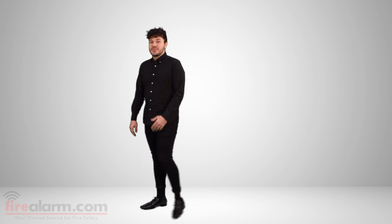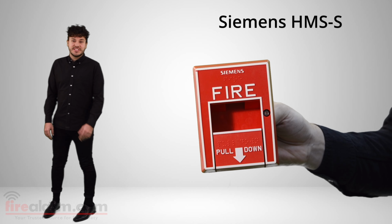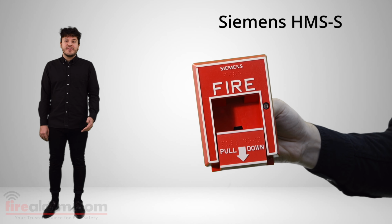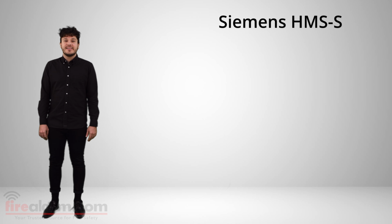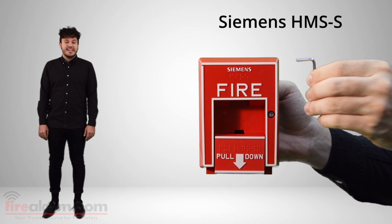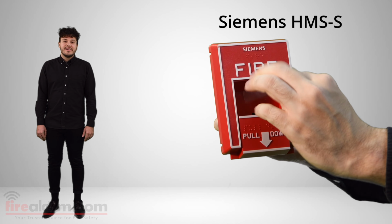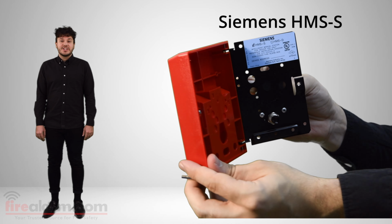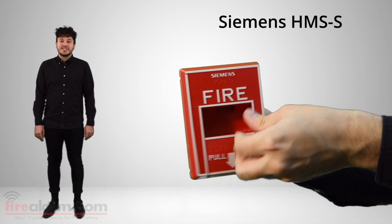Next, we have an older addressable Siemens HMS-S manual station that is a single action device. This device specifically can only be reset using its accompanying Allen or hex key. Just as if you were using a key, just insert the hex key, turn, open up the station. Please note that some manual stations will have a switch inside that you may actually have to physically reset. After this, close back up your pull station.